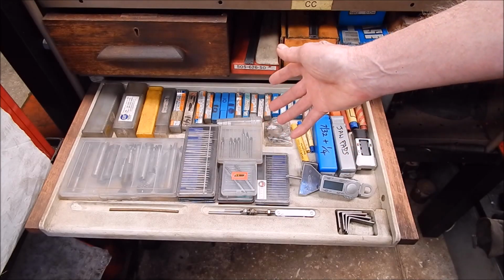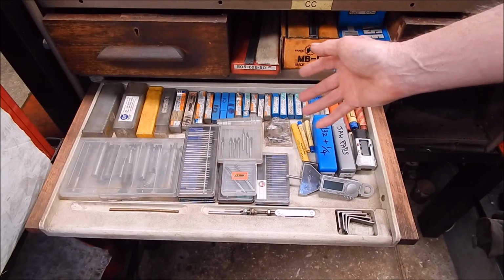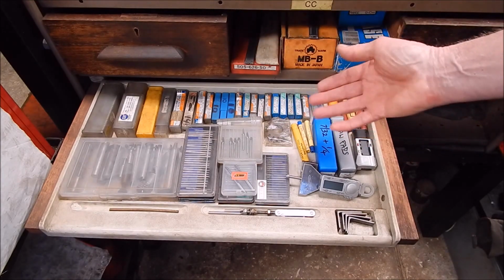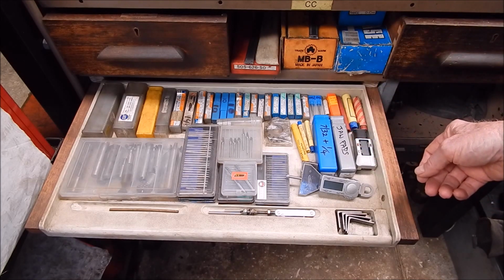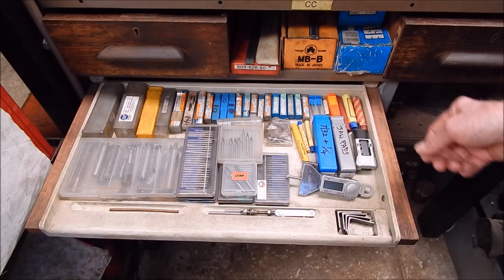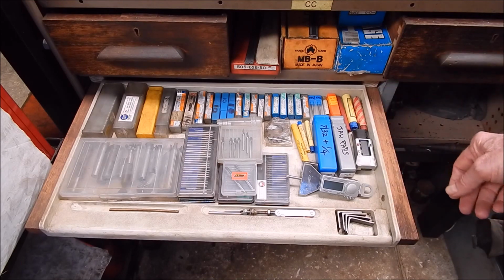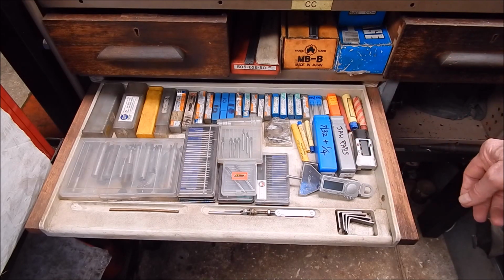And once again, speed-wise, there's all these feed rates and speeds. It's beyond me, and I just start off at a moderate speed and feed, manually, and see what looks good. If it's too slow, I'll speed it up, and if it's struggling, I'll cut back the feed rate. And it's all basically just going to be fly by the seat of your pants stuff.